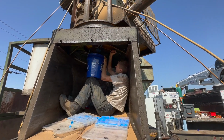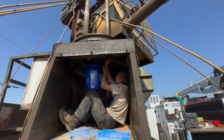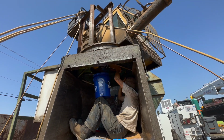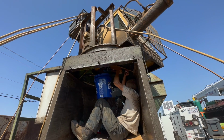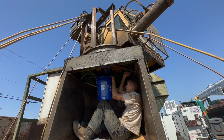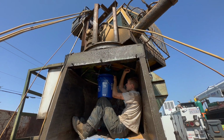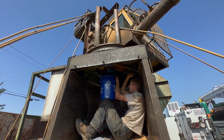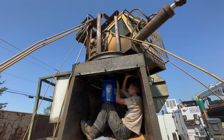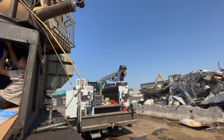All right, we're back out here on this pile. So we're disconnecting the electrical and hydraulic lines that basically go up into the cab. There were 22 electrical lines or wires that go in there, and they were all the same color, and there's no quick connect or nothing like that, so we labeled them all with tape and numbers, and then there's just a couple hydraulic lines there, and we can start working on those bolts on that ring, and hopefully we can lift the sucker off here and see what else we can find.